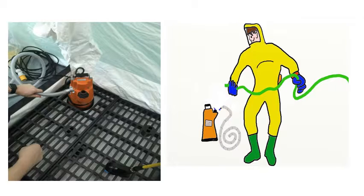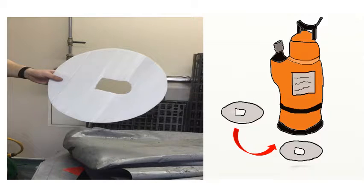Ideally, the shelter will be placed on a slight slope. Prior to using the pump, remove the hose and prime the pump with 1.5 to 2 litres of water. Also, do not run the pump until the hoses are running. The pump will also need to sit on a perspex disc with a hole cut out, the pump sitting directly over the hole. Again, the waste pump should only be turned on after the showers are in continuous operation for several minutes. Operating the pump in a dry condition will cause damage and failure.